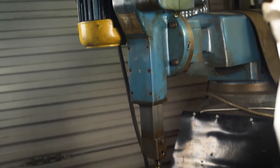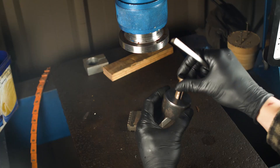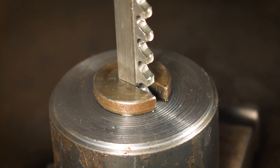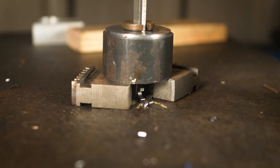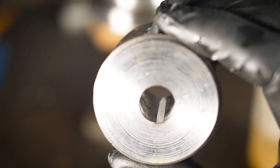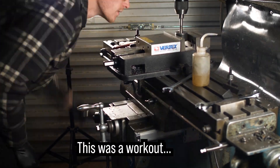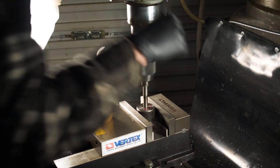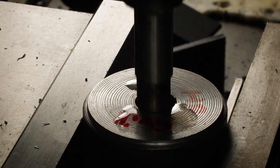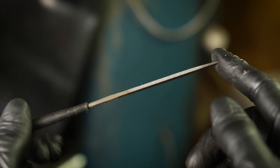Setting this slotter up was a lot of work to align everything, and that got me thinking — if you don't have a slotter, there are of course other ways. The fastest and easiest method would be keyway broaches, preferably using an arbor press, but I'll demonstrate with a hydraulic press. A few more passes with a spacer would quickly establish the full slot. The other way would be to manually slot using the mill, either by raising the table or using the quill. And finally, if you are adventurous or extremely bored, you could always try the trusty hand file.